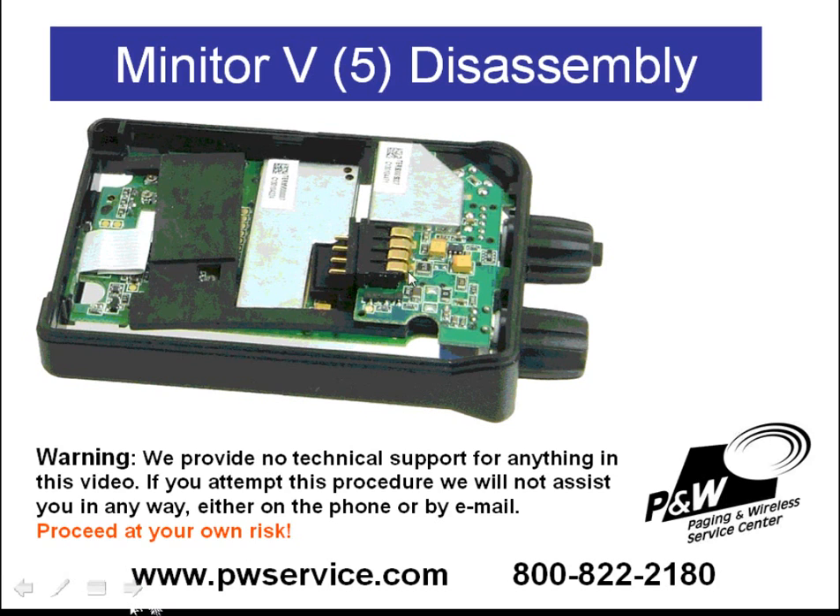On this side you'll see two circuit boards — there is a switch board here and a decoder board here. The switch board has connectors which go into these knobs. You'll need to be careful when you're removing the switch board not to damage the knobs that are attached to it. To do this, you need to disassemble the decoder and switch board in the proper order.